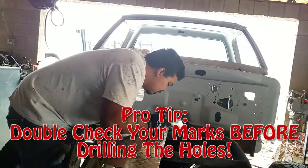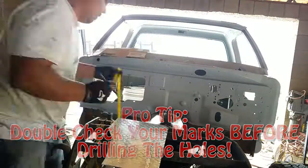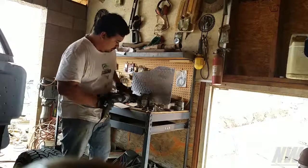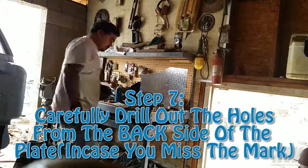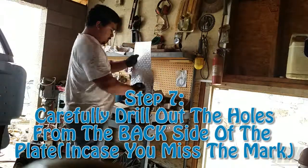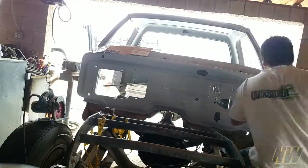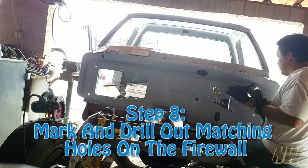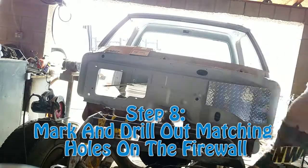Now the next step is definitely to mark your holes. Easiest way I was able to do this is from the farthest corners. After you got the corners out, put the holes in the diamond plate first, and then after you have the holes, only drill 2 holes out of the holes in your truck's or car's firewall. And then after you got those, make sure to secure those, and then after those are secured, you can go ahead and drill out the rest.